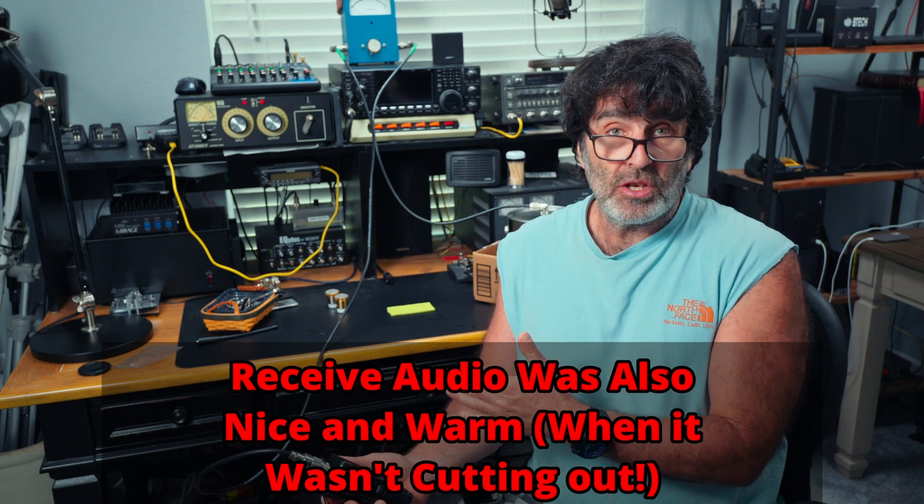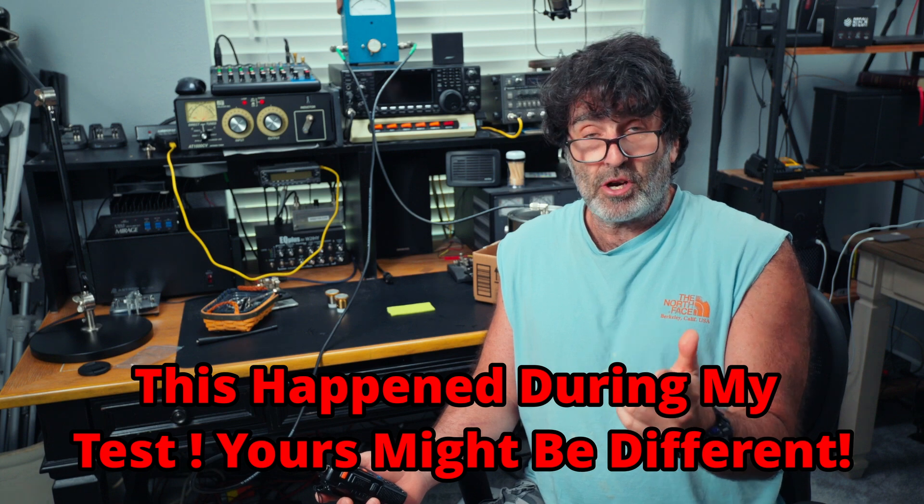Battery life seems pretty good — I did a lot of testing and had a long QSO after filming, and the battery held up well. One issue noted: there was some receiver cutout earlier that I initially thought was a microphone problem, but it turned out to be this receiver cutting out. It seems to happen when there's high deviation — the receiver doesn't like it. It's not a major problem, but worth knowing. Overall I do like the radio and think it's worth it, especially for around $70 in 2025. It's a good radio. I hope this video has been helpful — thanks for watching.